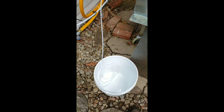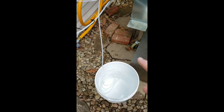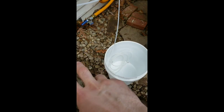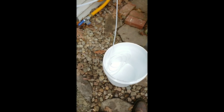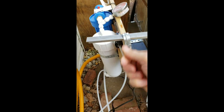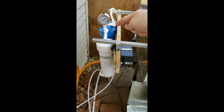The permeate line we've just got going into a five-gallon bucket. When we start concentrating, we're going to move the concentrate line to a five-gallon bucket as well. The goal is to reject five gallons of water and collect five gallons of sap — a 50-50 split — which has doubled the sugar concentration of our sap. I'm going to start up the RO by plugging it in. With the needle valve all the way open, we're just going to have sap coming through at low pressure, saturating the filter and the reverse osmosis canister, and being discharged back into our gathering tank to get all the air out of the system.